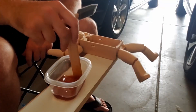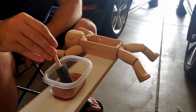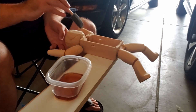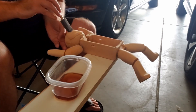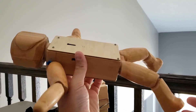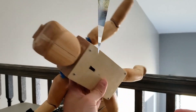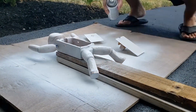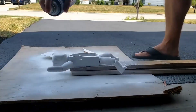So I continued on to the real thing, first painting each side with a couple coats of wood varnish — 60% oil polyurethane and 40% paint thinner — giving it four hours to dry, and then painting it once again with 80% polyurethane and 20% paint thinner, and then after 24 hours of dry time I coated each side with primer.